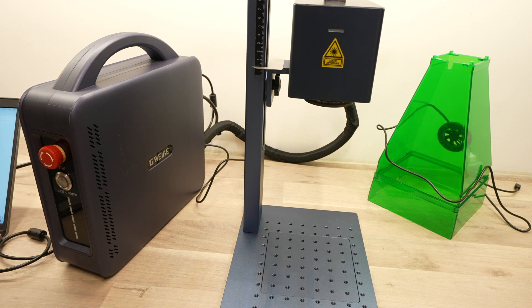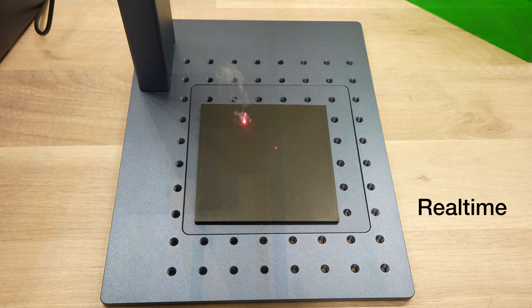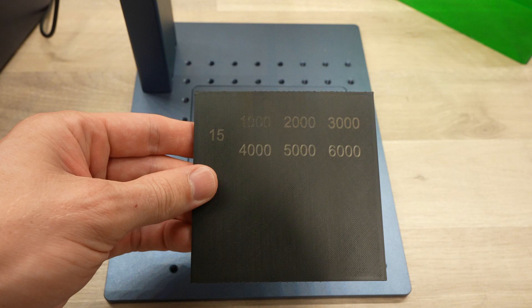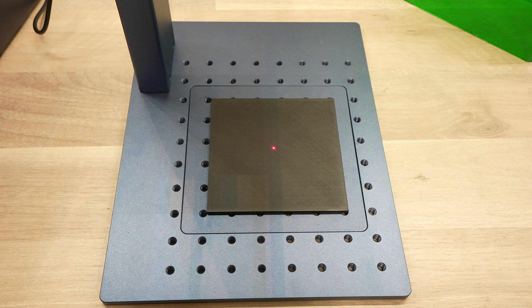To figure out what settings produce the best results on 3D printed parts, we first need to do some testing. There are a lot of variables that can be tweaked, but the main three settings are the laser speed — how fast the dot moves across the surface — the laser power, which is how much of the laser's strength is used as a percentage, and the frequency, which is how quickly the laser dot pulses on and off. I ran quite a few tests, and my findings were that the laser's speed needs to be quite fast, the power needs to be very low, and the frequency works best at the higher end of the range. With the G2 Pro, these settings are a speed of 7,000 mm per second, a power of 15%, and a frequency of 150 kHz.